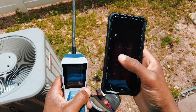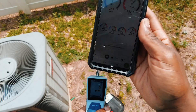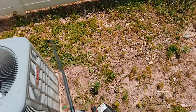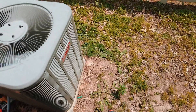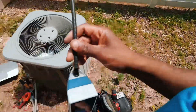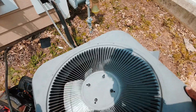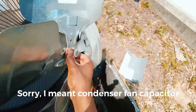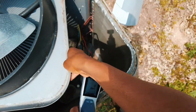We know we've got low charge, so I'm just going to go ahead and cut the system and do our check. It's been running for a good 15 minutes and we're not looking good at all. Thinking about what likely could have happened — it probably just blew out due to excess pressure, maybe the dirty condenser coil, or a failed condenser fan motor capacitor.